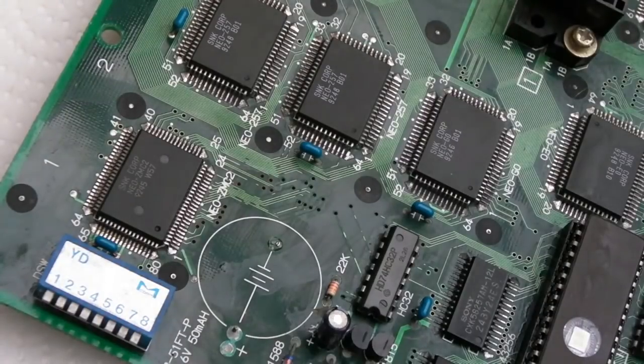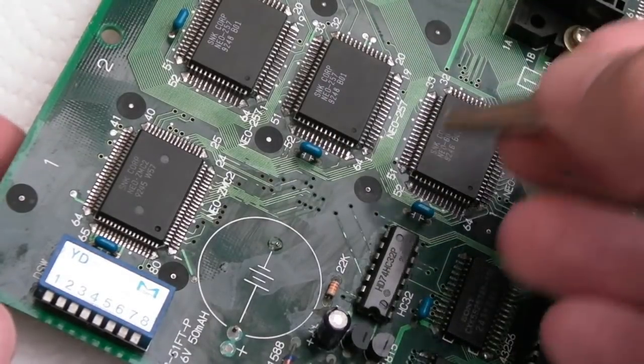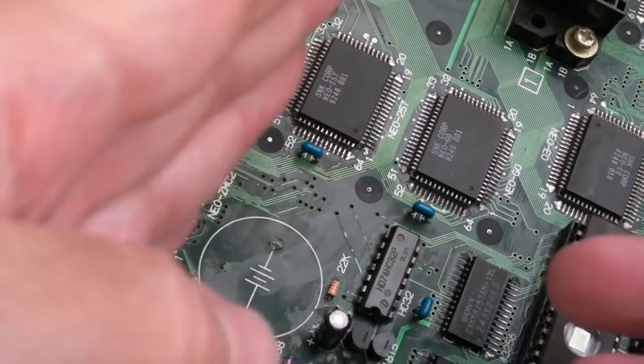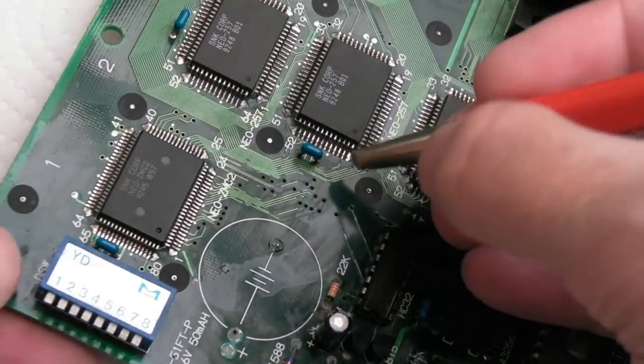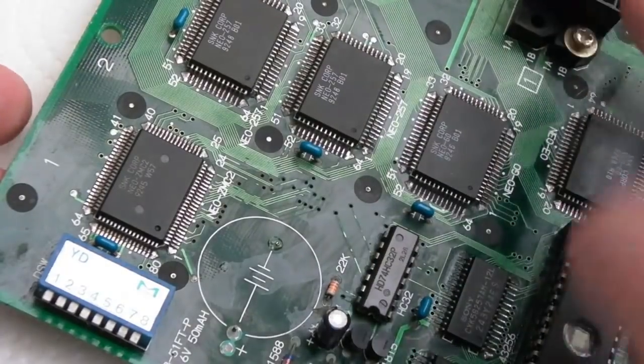So it's no difference. One thing I did notice is the top slot nearest the edge of the board, there's no sound. We didn't test both slots with sound. We just put it in the first slot, put it in the second one, and then out of the speaker. So the sound's still there, but it's not on the top slot. This slot up here, that one works.